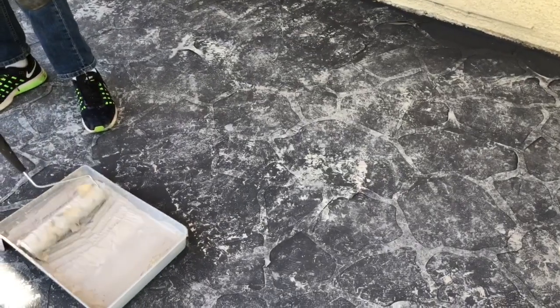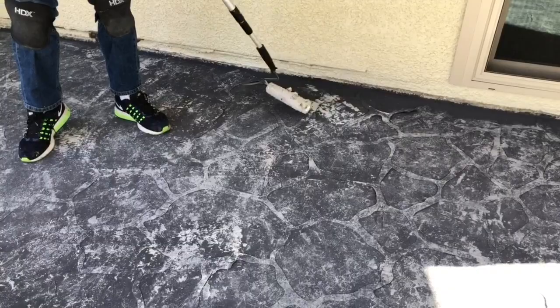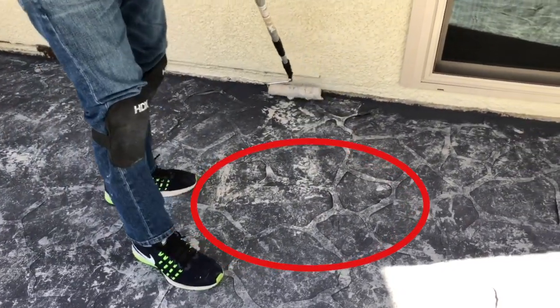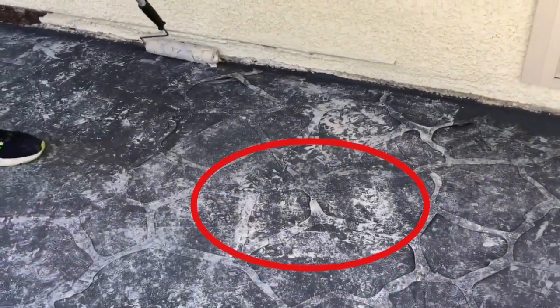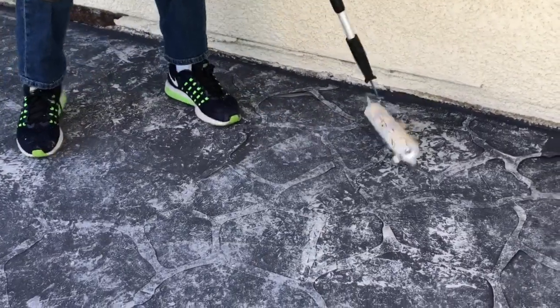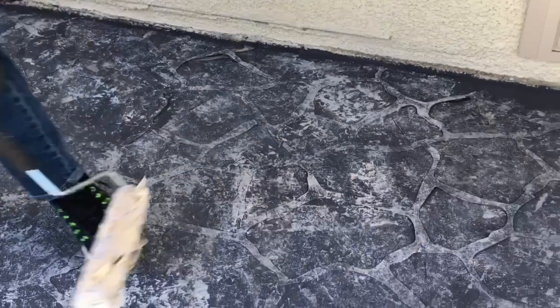After doing the first accent coat, see if there are any spots where you think you might want to dab a bit extra, and do so. If you think there are areas you've applied too much of the first accent color, don't worry about it. When you roll on the second accent color, those heavier spots will almost disappear, as the second accent adds natural looking mixed effects.